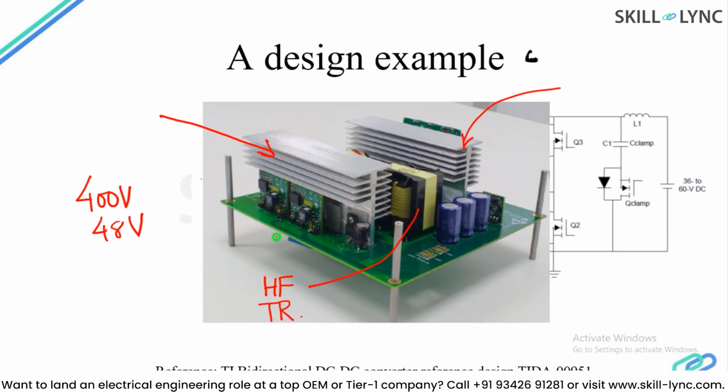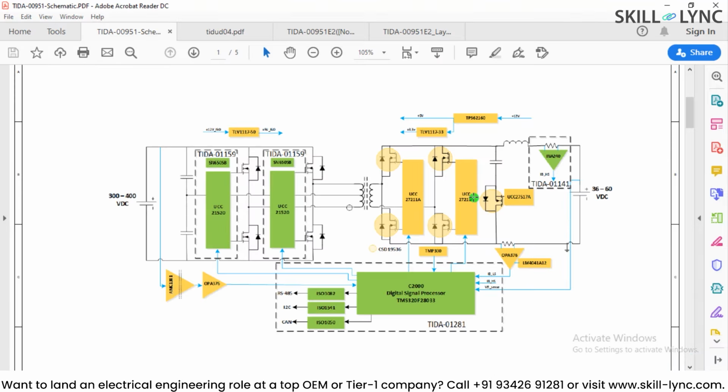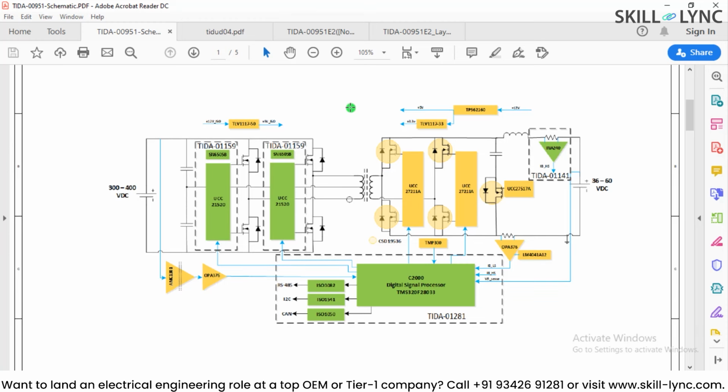So over here, we will be analyzing this printed circuit board, and we will be able to do the fundamental signal integrity and power integrity analysis. What I am showing you here is the fundamental layout of the printed circuit board, and what we see as a circuit and what we see as a schematic are completely different, because we have to include all the involved components. For example, on the high voltage side, you have gate driver circuits like UCC21520 for each leg, and for each leg this is going to be another design or another add-on card.